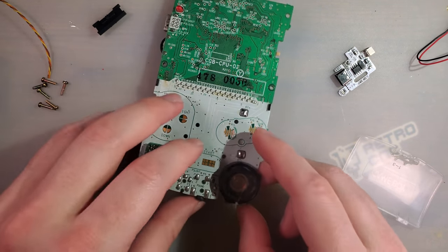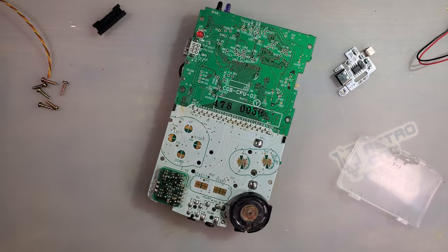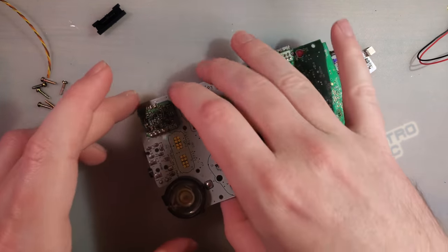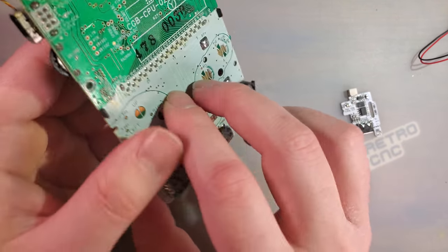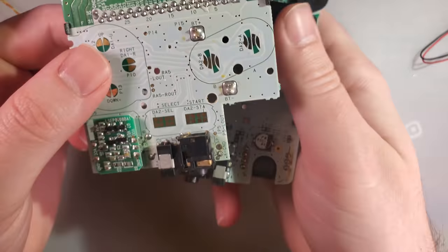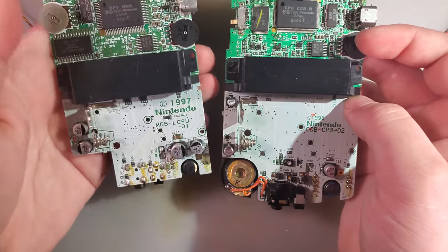We need to focus on this side of the console. I think I will put a new speaker in this too because it's kind of messed up — I'll do that later. So we need to desolder quite a few things here. We need to remove the power jack and then a few of the components in this area, because this board goes right there. So we need to remove everything that goes under this board. And I know what some of you might be thinking — yes, the Pocket does use the exact same power jack. So technically this is electrically compatible, but because the jacks are on the other side of the board, it's not going to be quite that easy.